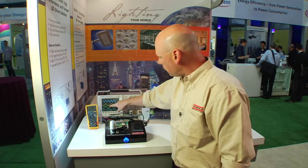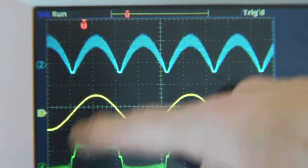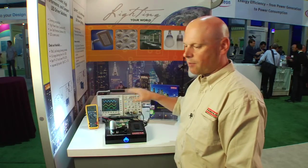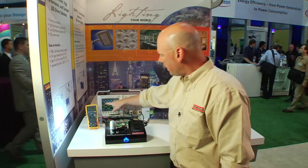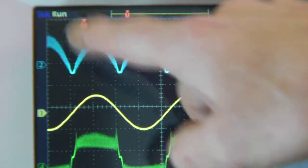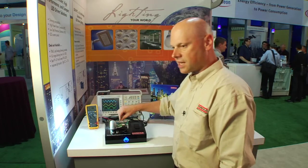What we have is our AC line voltage coming in. This is our AC current — you see they're in phase, it's quasi-sinusoidal, it has a power factor of about 0.95. The LED current right now is showing 100% ripple current, but we control the LED current through this device as a constant current regulation.